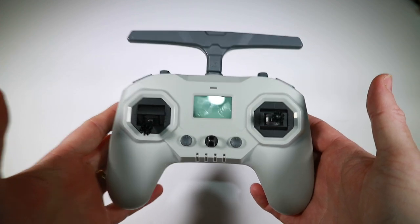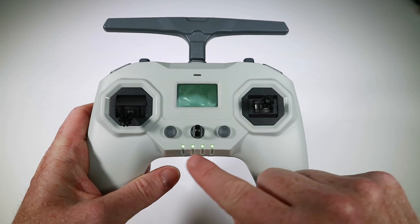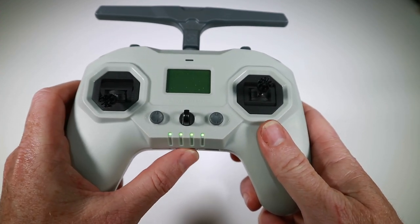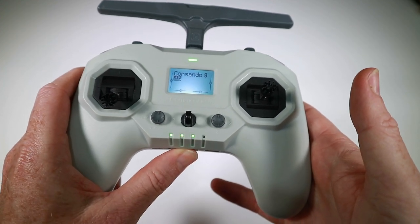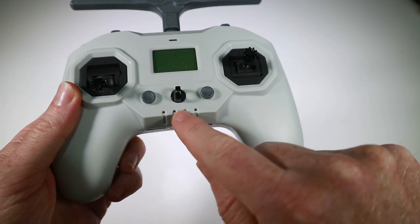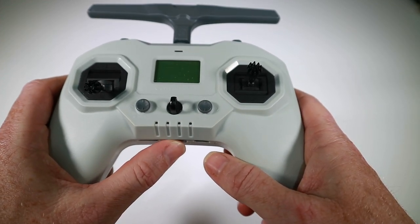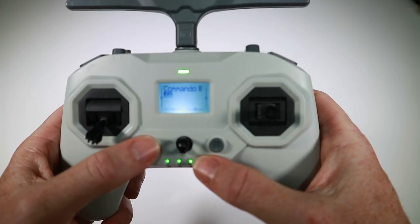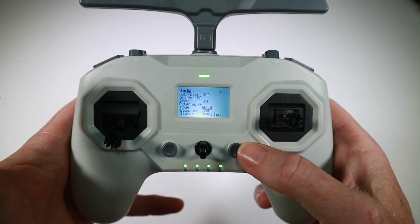Just before we test this out and fly, I want to go through a few things because some are a little bit different from a normal radio — one is how you turn it on. If you just press that button it shows you how charged it is. To actually turn it on, it's like a DJI quad: short press then a long press and the lights go up. Welcome to EdgeTX! And it's the same to turn it off — short press, long press, and it shuts back down. When you plug in power you'll see the lights showing charge level, and when it gets to four it's full. ExpressLRS is on what looks like an external module but is fixed in there, so when doing your setup you still use External RF mode with CRSF, and that is your ExpressLRS.